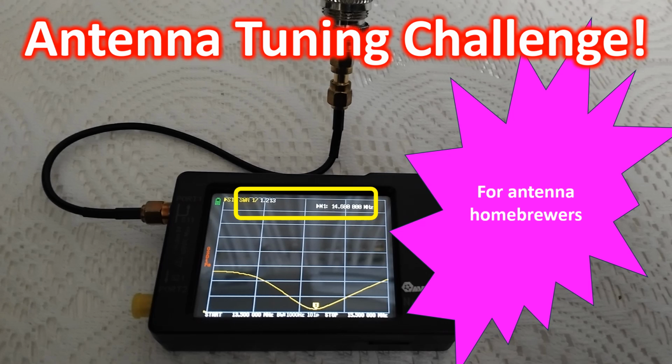So the difference in wavelength is 88 cm. 1/4 of it will be 22 cm. Each side of the antenna will have to be lengthened by 22 cm.